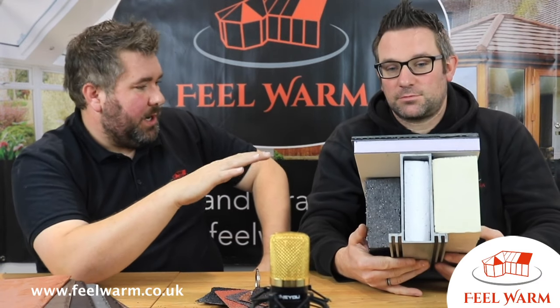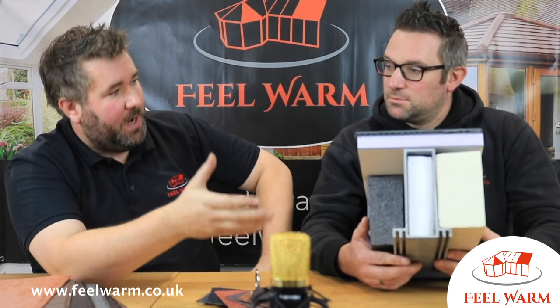Okay, so if we've got a timber board on top, like in other systems, and it's a cold roof system, it means it has to be ventilated underneath the tile. Is that right? So it's got airflow. Yeah. And with airflow, obviously, cold and hot air meet underneath those tiles. That's where your condensation problem is, right? Absolutely. And it's one of those things you're never going to see until it's too late. Because it's already got down to the timber boards, it's eating through the membrane, from years of being damp and wet, drying out, getting wet, drying out.